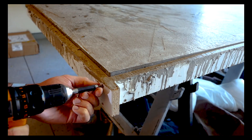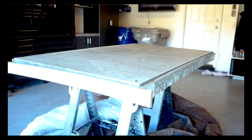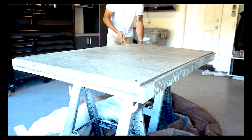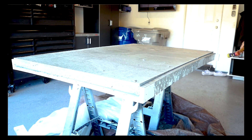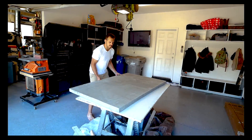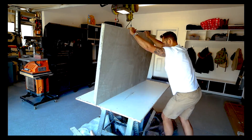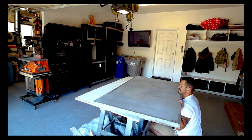After three days, take the screws off. Be very gentle around this concrete — it takes 20 days to fully cure. Use a small mallet very lightly and carefully to pry off or knock off the side molds. Very, very delicate — if you hit a corner it will chip on you. Since the bottom of the slab in the mold is actually the top of our slab, we're going to flip it over very gently and carefully.